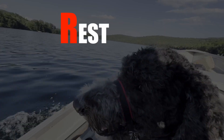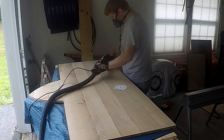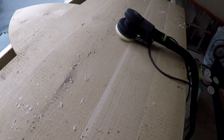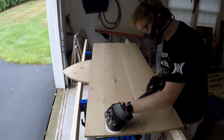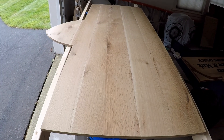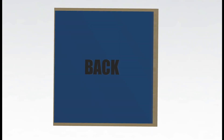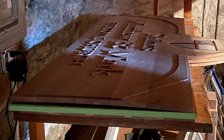As you do, I brought the sign with me on vacation for a little R&R — rest, relaxation, and over-engineering. I commandeered half of my in-laws' garage, set up a rickety workbench, and got to work. I started with sanding to remove milling marks, glue squeeze-out, and water stains from storage. The challenge was to affix these somewhat volatile solid wood skins to the plywood core securely enough to hold them flat, but not constrain them so much as to lead to cracking.